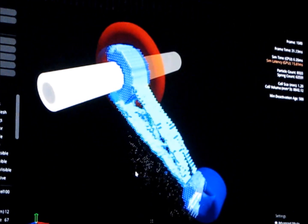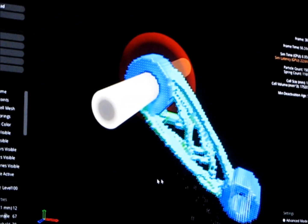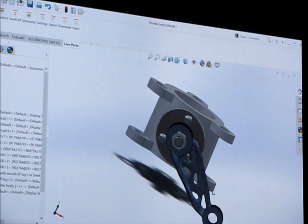The tool allows users to import constraints from their native CAD program, automatically grow a part, and export it for printing or back into SOLIDWORKS. It's a totally different approach to the way things are created because it's not generating many different designs randomly. Instead, it's creating a design by developing it from a seed cell into an organism, optimized for its environment, constantly adapted to changes in the environment, changes in the forces, creating lightweight parts that are strong and fatigue-resistant.